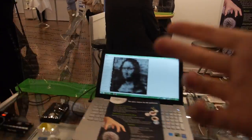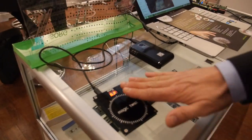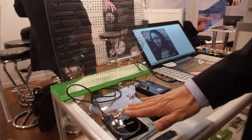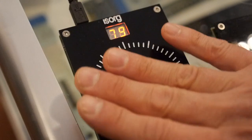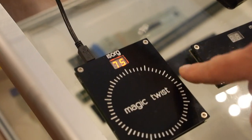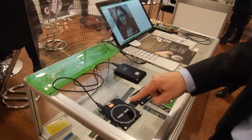This is the typical foil we are manufacturing in the pilot lab — these are individual photodiodes. Each point is a pixel, a photodiode. You can use this for user interface products where you interact without touching the surface. The number indicates that you are detecting the position of a finger all over the surface. There are typically about 12 sensors. A typical application is for home appliances, where you can interact with a surface even with grease or water.